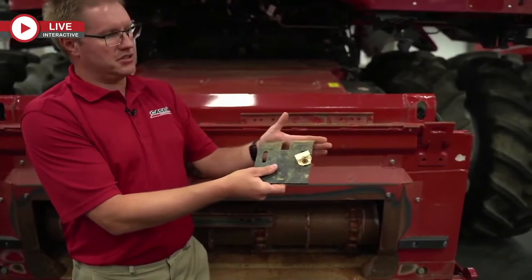Louis talked about the automated combine having pressure sensors that the competition doesn't have. For maintenance on those pressure sensors: if you're in really green, sticky canola, make sure you clean the sensor off. It's located inside on the sieve rail. A little brush will wipe them off. Also, if you're washing your combine, make sure you don't spray water inside those sensors — put some duct tape over top of the sensor first.